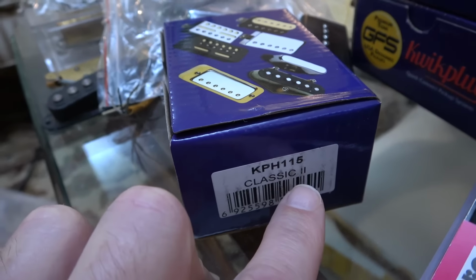Now, was that necessary? Probably not, because we do have the shielding, and all of these pots are also touching the shielding. But and the switch too, for that matter. But I like to go ahead anyway and wire all the pots together just in case, so you don't have any ground issues later on.